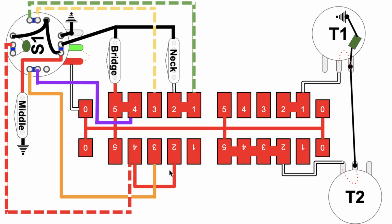So there's a lot of that going on. These are jumpers, and also you've got this jumper on the back, as I mentioned earlier, on the back of the S1 button that goes from this little node over here to this one through that capacitor, and then you have these 2 black wires, which are hardwired jumpers going from these nodes to those nodes, as indicated.